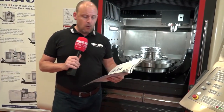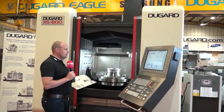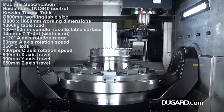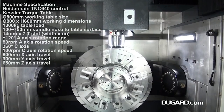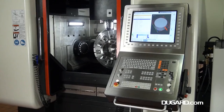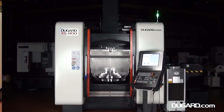Just to touch on the machine size: one thing that jumps out is it's a 20,000-kilogram machine — absolutely huge, certainly built to last. You've got 800 millimeters in the X-axis, or 900 or 1,050 millimeters in the Y. The Z-axis is 650 millimeters. Maximum table load is 1,300 kilograms, and you can move all axes with 1,300 kilograms on the table — and it's not slow either. With a machine of this size you might think you'd have to compromise on speed, but it reaches 48 meters per minute.